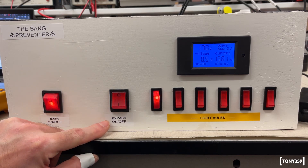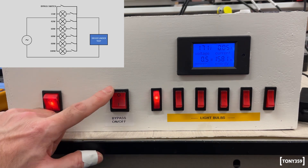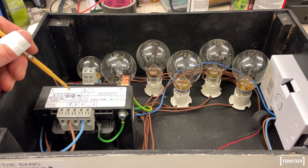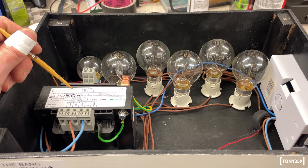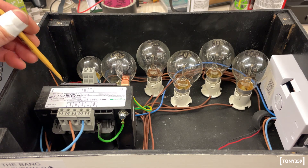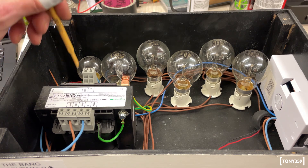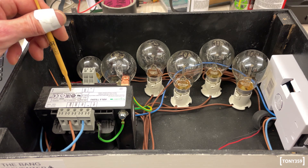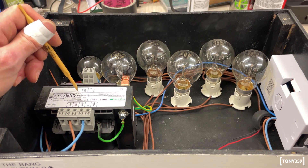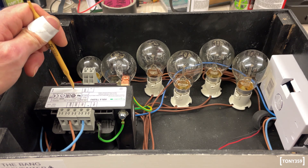This little switch is basically a bypass. If I wanted to temporarily bypass all the light bulbs and just feed the output of the isolation transformer straight to the output, I can just flip this one — and you can see it goes back to 260 volts. I also wanted an isolation transformer for when I'm working on live equipment, mainly power supplies. There's a very nice video from Mr. Carlson's Lab, which I'll link below, on why you want to use an isolation transformer. The point is to isolate you from the mains — after an isolation transformer you can unintentionally touch the live conductor and not get shocked. You will not save your life all the time; it's only reducing the risk.